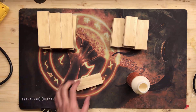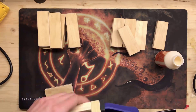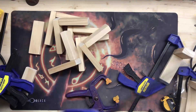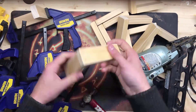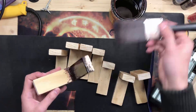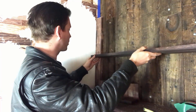Now it's time to start building the upper shelves. I looked at a few different existing shelving options but didn't find anything I liked, and I found that existing mounting hardware was more than I wanted to pay, so I made up these wooden mounting brackets — cut them to shape, sanded them, glued them together, clamped them, and then nailed them, and then stained them. By the way, stain before you glue. I ended up with some glue marks where the stain didn't adhere, but you don't really notice it in the final product.